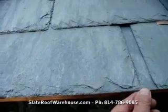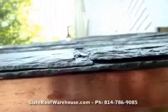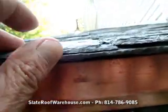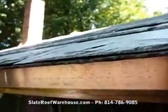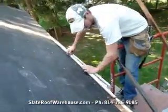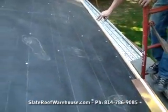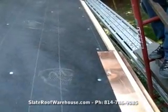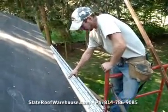Notice the starter slate is installed back side up, the bevel is down, so that the two slates merge to a point on this edge. This is standard traditional slating. Traditionally a little strip of wood is used, just nailed or screwed onto the edge, but here we're using this copper drip edge with a cant to dress up the roof a little bit and make it a fancier job.